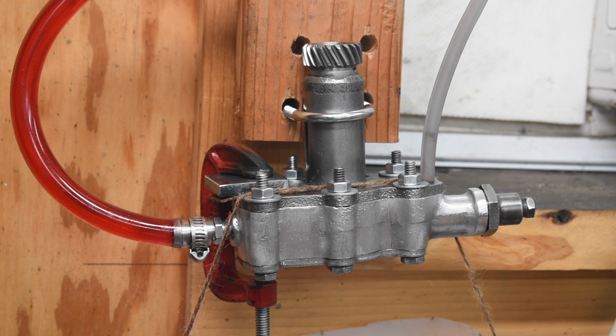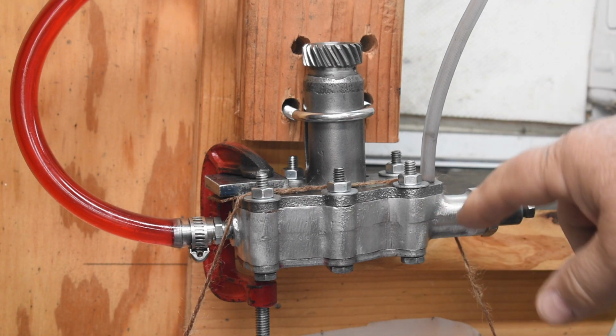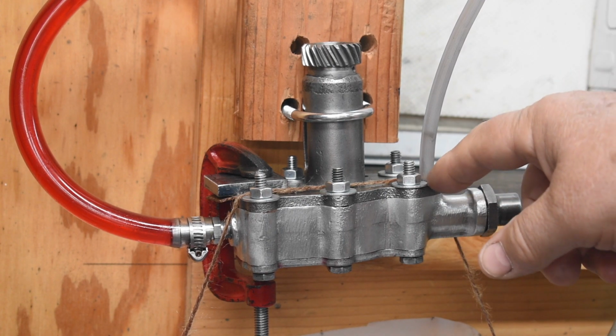Right now I'm just trying to prove whether or not the spring is the actual problem versus some kind of subtle damage to the ball in the seat that isn't really detectable with the naked eye. So I've got this really stout spring stuffed in there right now. Got the test set up, hooked up again. This is number 5. Obviously, I wouldn't run an engine with an unknown spring in there, but we're going to experiment a little bit.